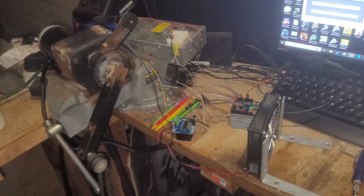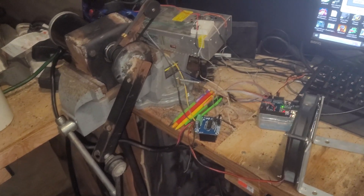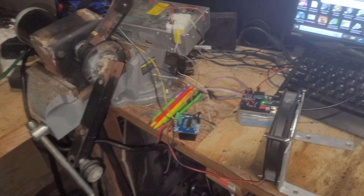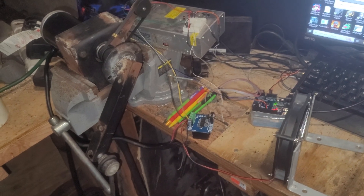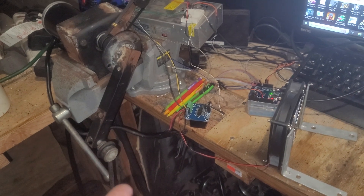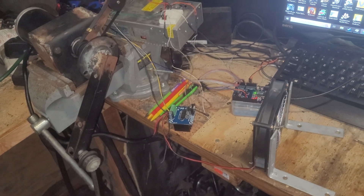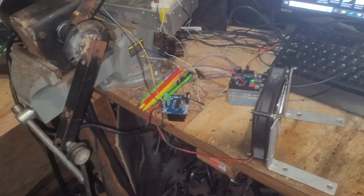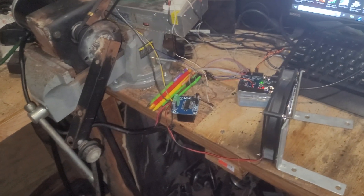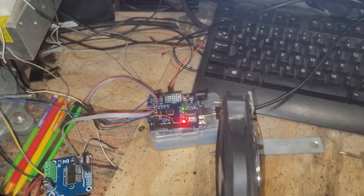We've got a quick little video here — just wanted to show how I test the IBT2s, otherwise known as the BTS7960s. This is how I test them for load: to see if they can handle 24 volts under actual load, see if they can lift weight, see how long they can hold it, and basically tell me which IBT2s are good and which ones are bad.